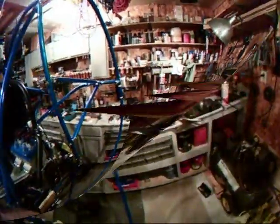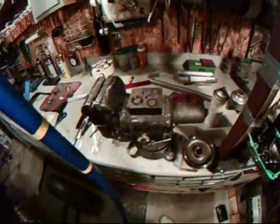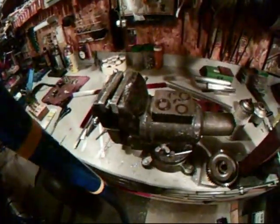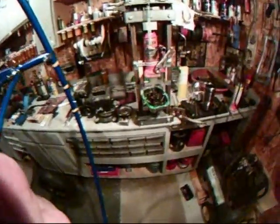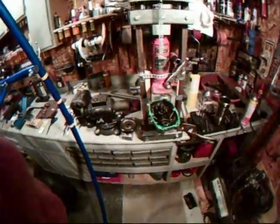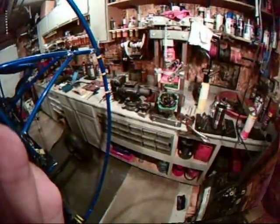Further disassembly of the half of the gearbox, with the components out: the dog gear out, the angular ring, shims, and half rings are out. There is noticeable wear on the components, but again, we'll get them all apart. We'll mic them and see exactly how much they have worn, and we'll point out the worn areas.